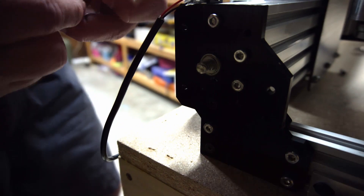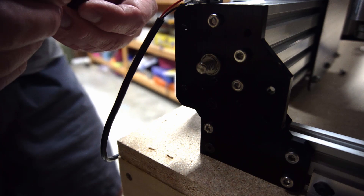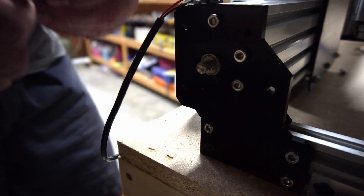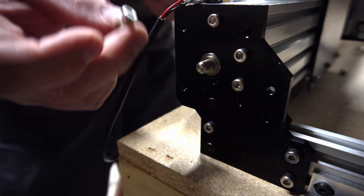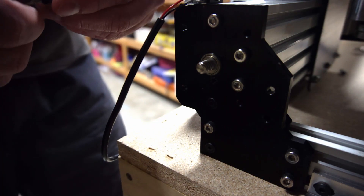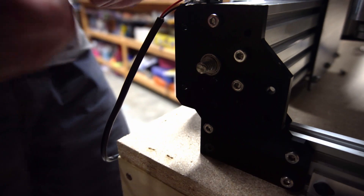There's no reason this isn't spinning fast enough for a bigger screw to throw it off balance or cause excessive wear. So I've gone ahead and used a four millimeter socket head cap screw and put that in there in order to get a lot more clamping force on this joint.